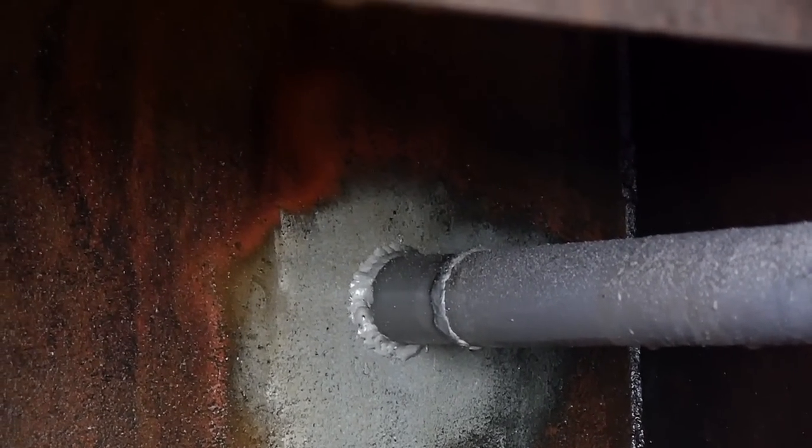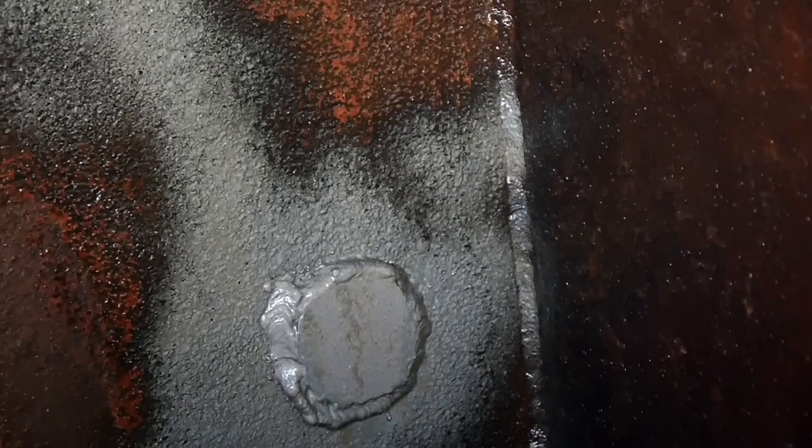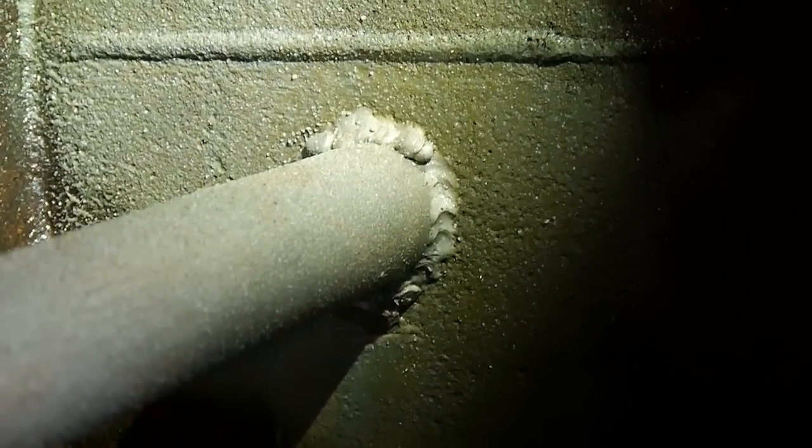Now that I've cleaned up both lots of steel, I'm going to run another bead over top just to be really certain it's going to seal up. Likewise with this one — they're certainly not the prettiest of welds and they're next to impossible to see when you're actually doing them, but I'm going to put another bead over everything just to really nuke it and make sure it's not going to leak. The bit I'm really happy with — I think I've found a solution to the challenge. The welds aren't the prettiest, but I'm pretty sure I'll get a decent seal. I'll grind a few bits off and run another nice solid bead all the way around.